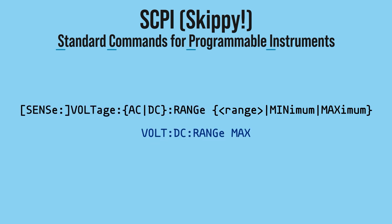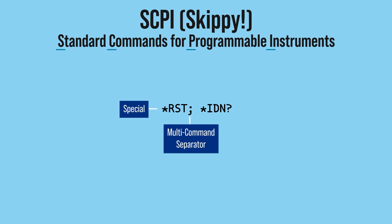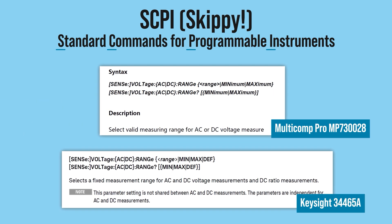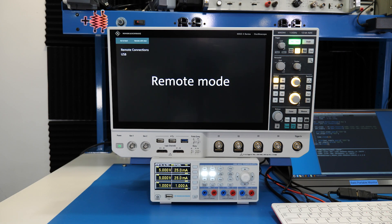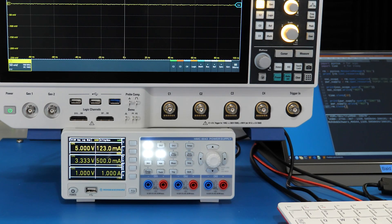This short form command sets the DC voltage range to its maximum setting. The asterisk character indicates a special command such as preset or identify. The semicolon is a shortcut to send multiple commands on a single line. The question mark is used for commands which should return a value. The good thing is that commands for instruments from multiple vendors may look very similar. The bad thing is that the behaviors themselves are not defined. For example, on this scope, star RST is the same as pressing the front panel's preset button, while on the power supply from the same manufacturer, that same command reboots the entire instrument — and when an instrument reboots, you usually lose the VISA connection to it.